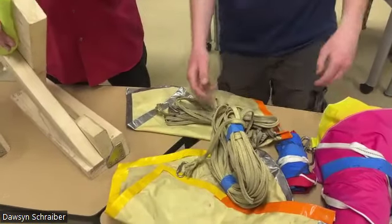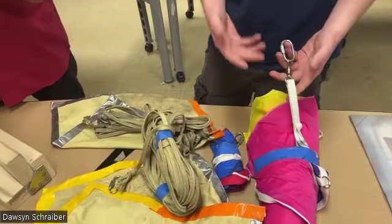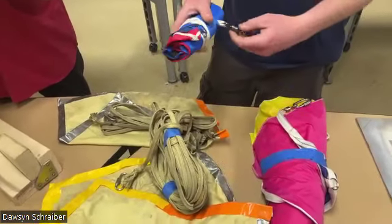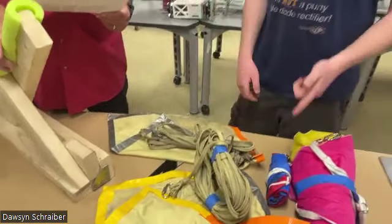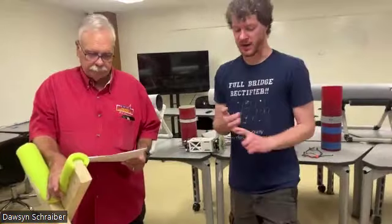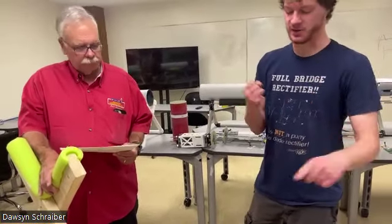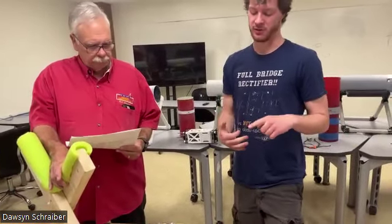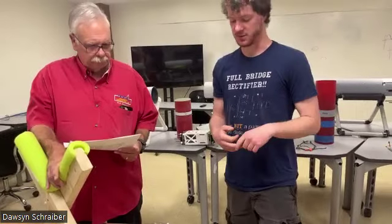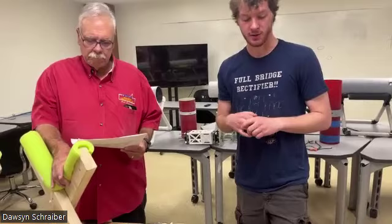Okay. We've got swivels on the parachutes to keep from tangling. They come with, so definitely. Drogue, I guess, comes out at apogee. Yeah, drogue is at apogee. We've got a couple backups for it off those altimeters. Primary is obviously at apogee. We got backup at apogee plus one, and then we have a tertiary charge that will go off if the descent rate is going too fast, and that's off of the Raven. That's going to be a bigger charge as well.